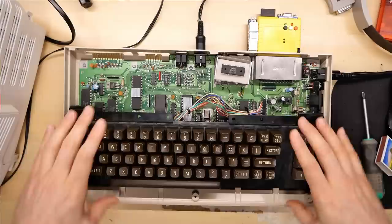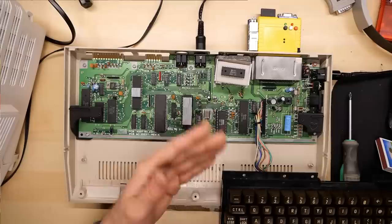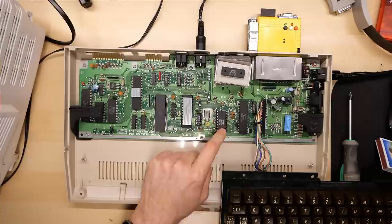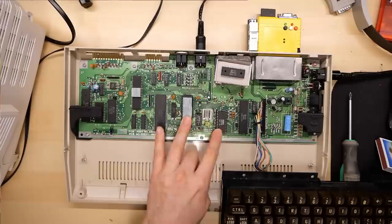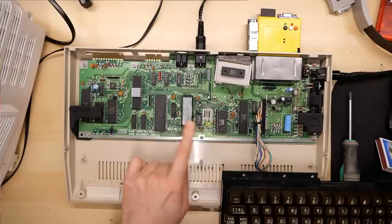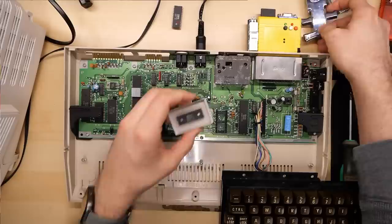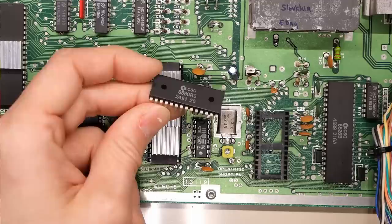One more I want to do — Ode to C64, which is the intro song from Sid Burner's 7. Let's hear how this sounds. Okay, this sounds terrible — really distorted and screwed up. On the screen it says this was composed in 2003 for a 6581, so this song may just not work properly on the 8580 that's in here. But the Sid Burner 7 disc was put out in the 2000s, and by then a ton of people had Commodore 64s. I can't imagine the creators would have picked a title track that sounds like garbage when playing it on a 64C with a short board. I think I want to swap chips and see if it fixes the sound.